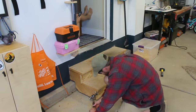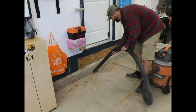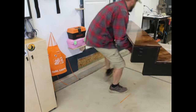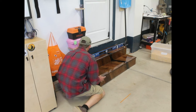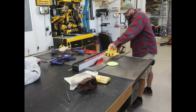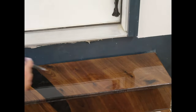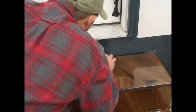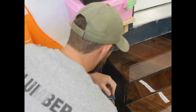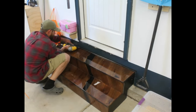Time to remove the old stairs with my wife supervising. The sledge, crowbar, and claw hammer ate through that particle board pretty quick. I'll remove the six years' worth of debris that accumulated under there and set the new unit in place. The garage slopes toward the door, so I'll add shims to bring it to level, then cut a pressure treated off-cut to the thickness of those shims and glue them to the bottom. I'll set it back in place, draw a line on the wall where drywall needs to be trimmed, use a couple of long pocket hole screws to anchor it to the house, and add a couple of 18-gauge nails on some trim to hide that drywall edge.